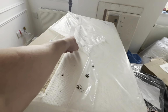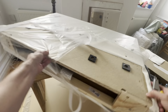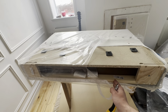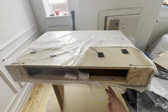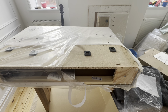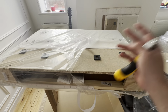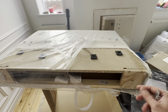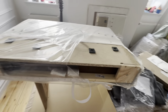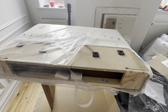I've removed all the stapling thus far to the mark where the wood will be cut. Upon further re-evaluation and thinking, realistically, for us to keep this all intact, after this has all been cut and taken out to shorten the arm, we'd have to actually remove all the stapling, slide the cover off, cut this, slide the cover back on, which is fine, that's obviously an option.